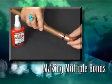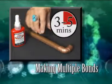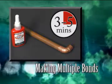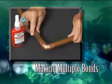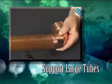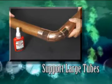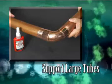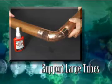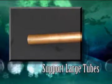When making multiple bonds on connectors, elbows, or T's, make the bonds one at a time. Allow each bond to remain undisturbed for 3 or 5 minutes, depending on the tube material you are bonding, before making the next bond. When making a bond involving a long length or very large tubing, support the tubing in the final position before making the bond. If the tubing is not supported, the bond will be broken from the stress on the bond before the 3 or 5 minute mandatory period. On large tubing, the bond can give way completely.